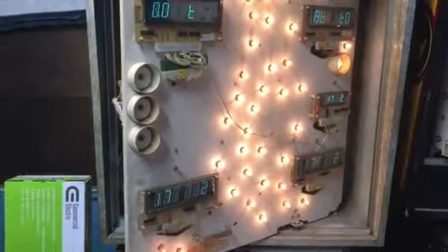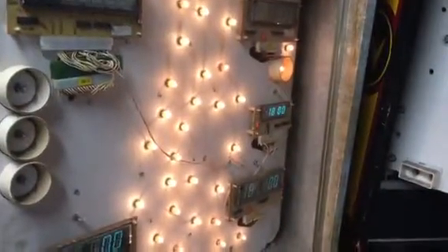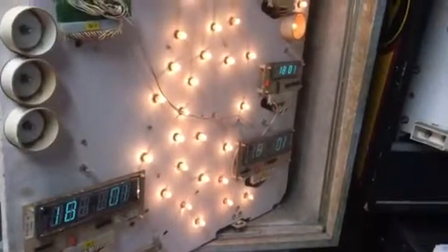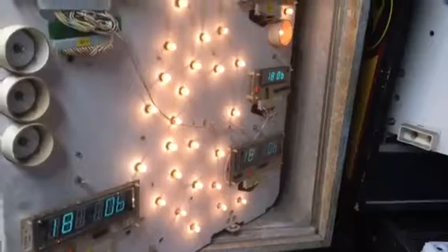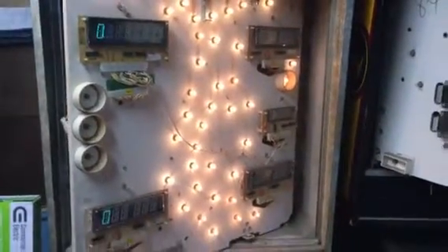Test 18 — I'm sorry — is the switch matrix. I've got my switch matrix tester here. I'm going to go across the first row and then down the first column, and you can see all of those are working. I'm not going to press this last one while it advances to the next test, because it's the same as the diagnostic switch. So this CPU board for the game is 100% operational.